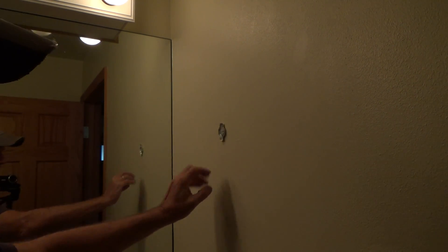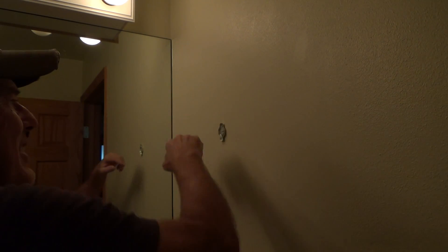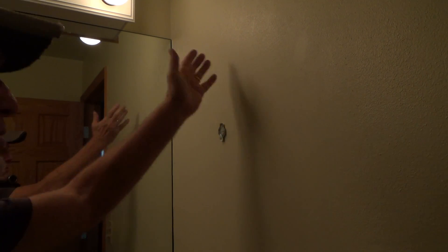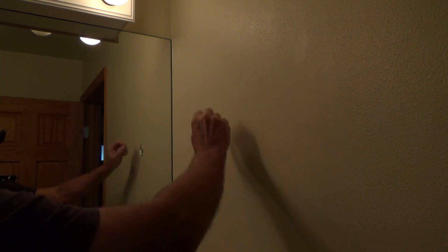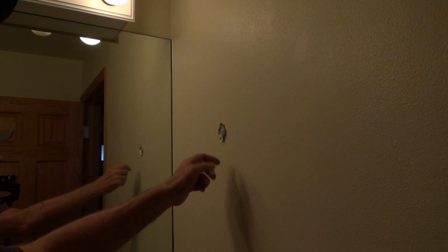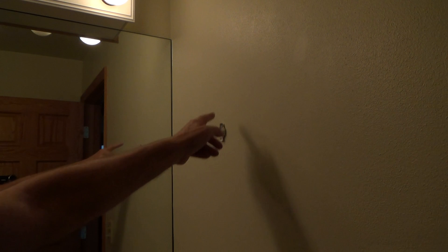If I take that off I can run the roller straight up all the way without going around it and then having to hit it with a paintbrush later — because this is semi-gloss. When you add extra paint around a fixture with a paintbrush rather than a roller it leaves different marks. The paintbrush is smooth, but whatever roller you use — 3/8 nap, 3/4 nap, 5/8 nap, even a smooth roller — is going to leave some slight texture on your wall.